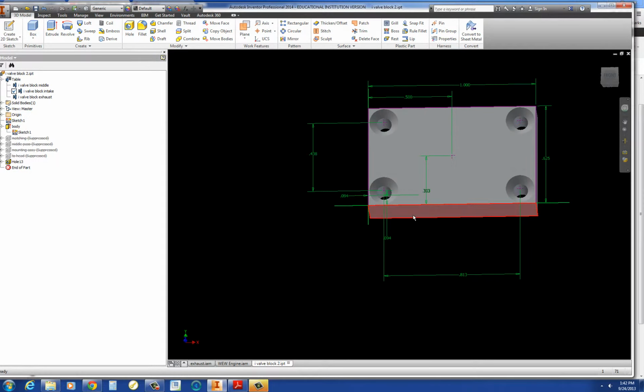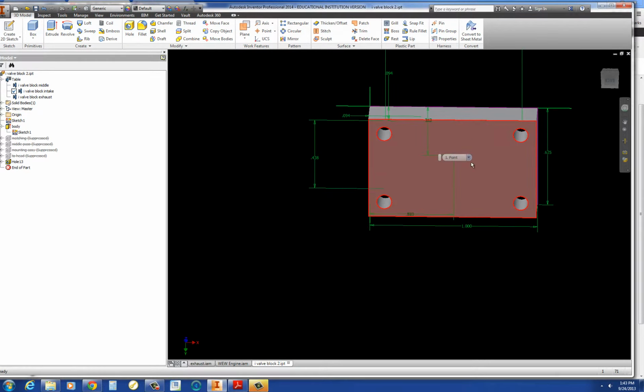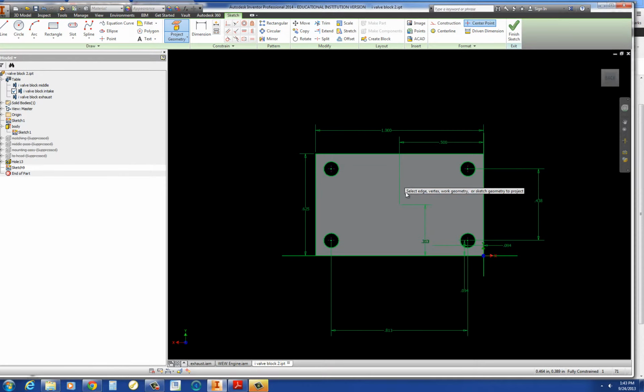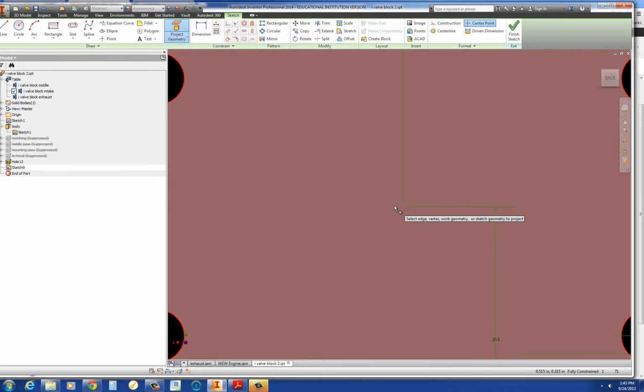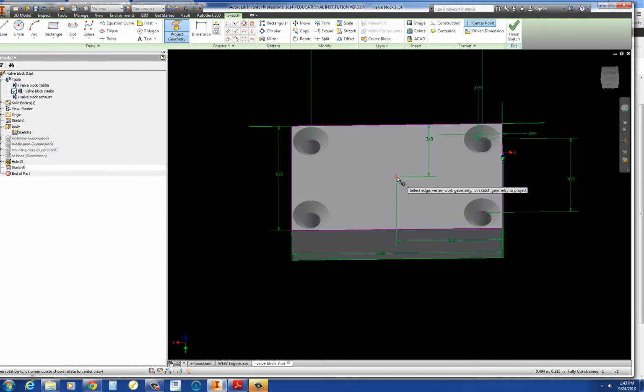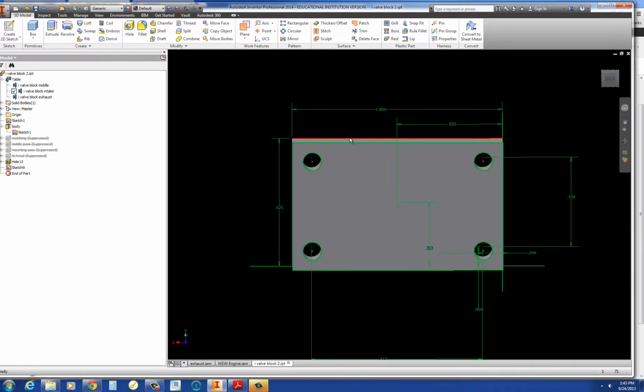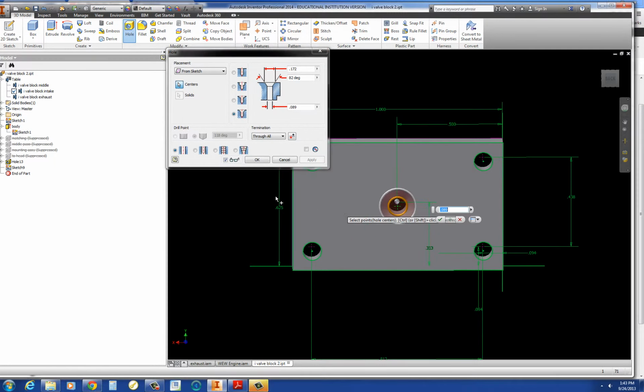Now this hole is supposed to be on the intake. The countersink is on the bottom, so I'm going to create a sketch on this one, and I'm going to project the geometry of that center hole, that center point, through that part onto that other surface. Say OK. So I'm essentially taking it from one plane to the next, and now I can say I want to make a hole with this point.